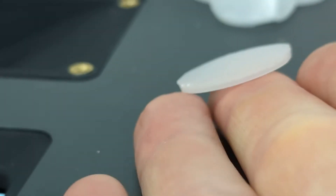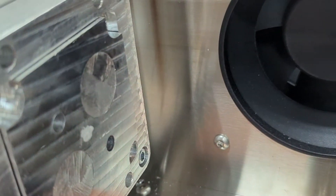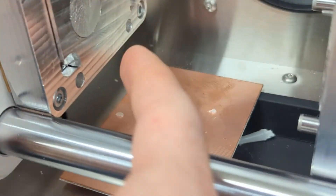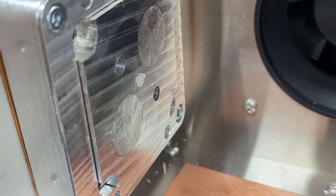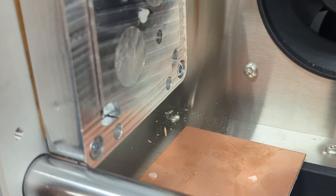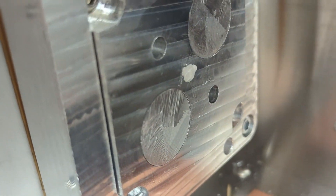In a production tool I'll have to slow things down. The intent — these little components are inserts, separate pieces of aluminum. I can take the whole tool off, unscrew it from the back, and place in new ones. The surface that ends up being the top of the bases can be swapped out for more interesting textures — a dirt path, grass, or something more interesting. That's something I'm planning to do with the Pocket NC. These are the surfaces creating that rough texture; right now it's just roughly filed. I do intend to make it more interesting, but for testing purposes it doesn't really matter, and it's way faster to mill out basically a coin with one ugly side than two sides that are very precise with fits and bores.